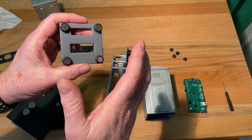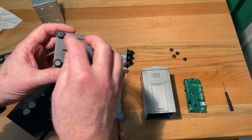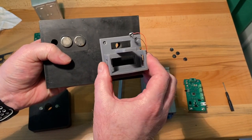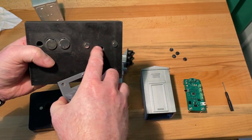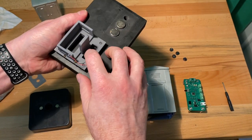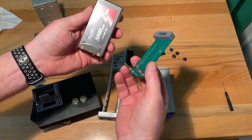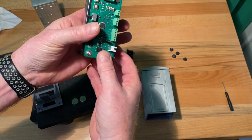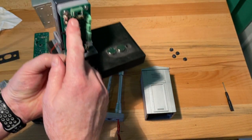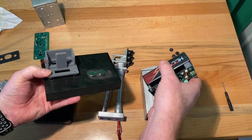We have a slightly different kind of footing that has room for a magnet inside the foot. We've put those in in the correct orientation. You take the four magnets that are loose, drop them into each one of the holes, then put a little dab of glue onto the second magnet — E6000 is better than super glue. Position the bracket where you want it. There's a hole here that has to come up through the front part of this setting, so drill the hole approximately where you want it. Let's put the battery onto the circuit board. Here are the banana plugs — just slide that in. Here's the sensor, and this sits in the forward orientation.